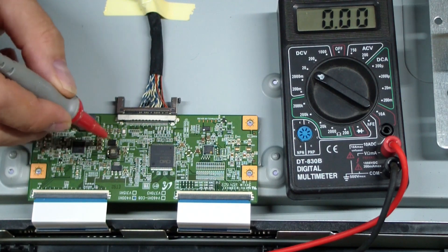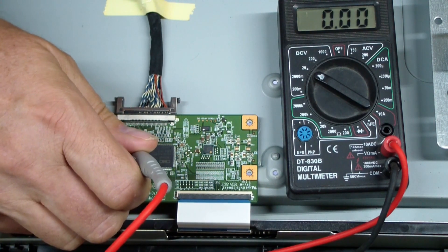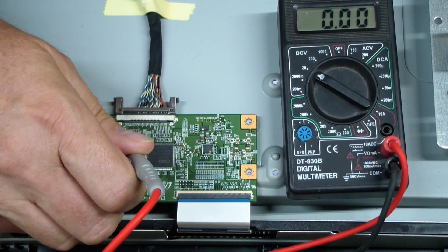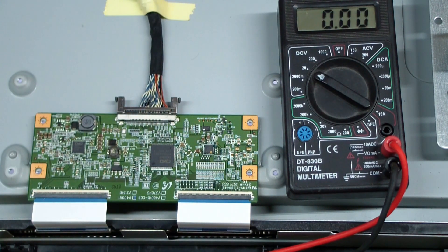There's a big diode here — nothing on that side. What I'm getting at is there's something really, really bad here. There's a power supply circuit with these two inductors — they're all part of it — and this thing is definitely dead. So I think I picked the right component on my lucky guess.